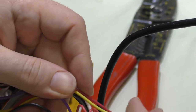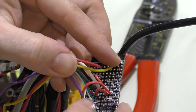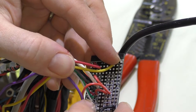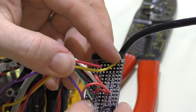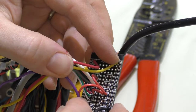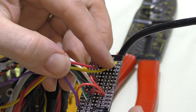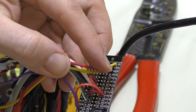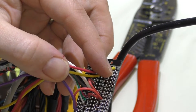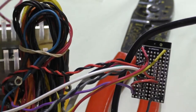The only thing left to do on this board now is get the various ground planes connected. You can see there are a couple jumpers on here already. Also note the USB green and white connectors — data-plus and data-minus — they come to the board and actually short against each other. The reason I did that is certain devices look at that connection to determine how much power they can pull. When it's shorted like that, many devices try to pull the maximum current from the charger.